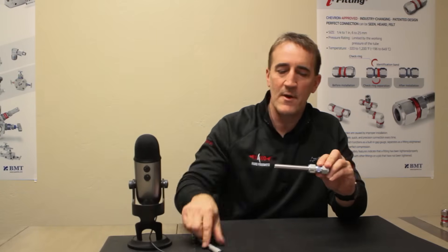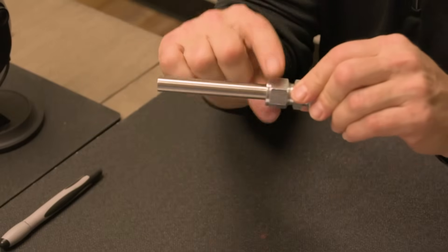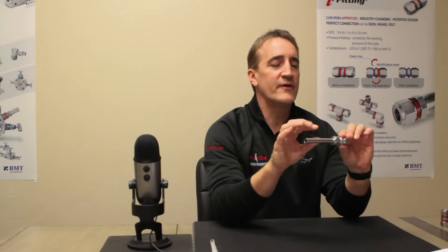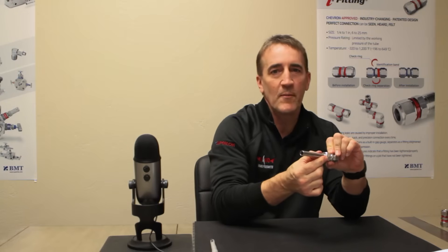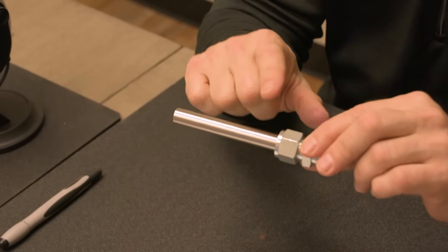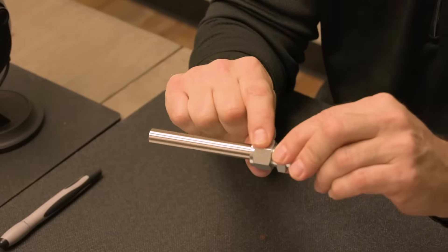But there's one other thing that we have to do, which I see in the market that not many people do. Every manufacturer has in their instructions that after a tube fitting is installed, we must use a gap gauge to check the gap between the nut and the body. When we finish tightening this nut correctly, there's only one spot that gives us the maximum sealing potential for a safe and sure connection. Under-tightening causes the ferrules inside not to bite, which allows pressure to release the tubing, making it become a projectile. Over-tightening can crush and damage the ferrules, crush the nut, and cause leakage. So we want to make sure that this nut is tightened to the precise spot every time.